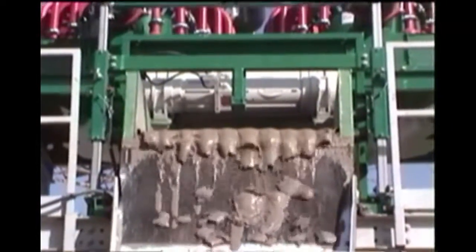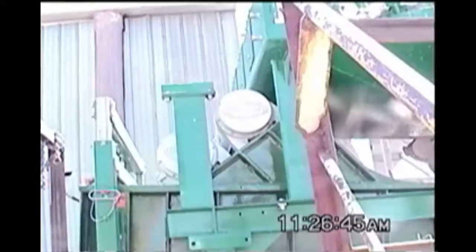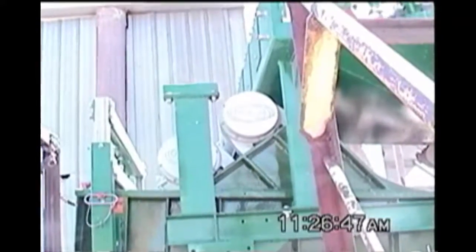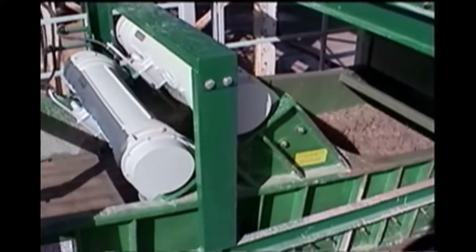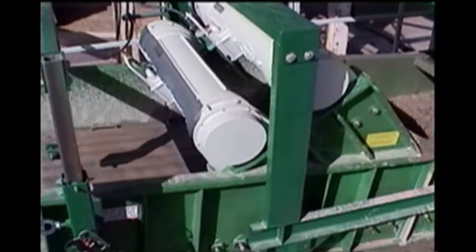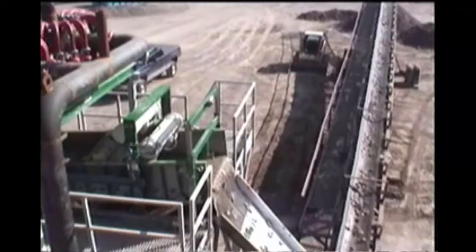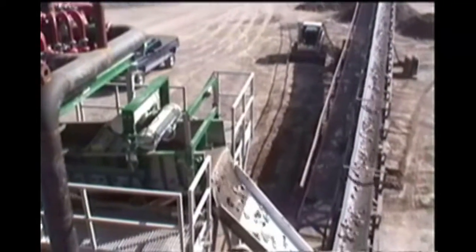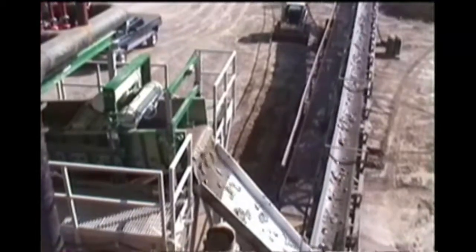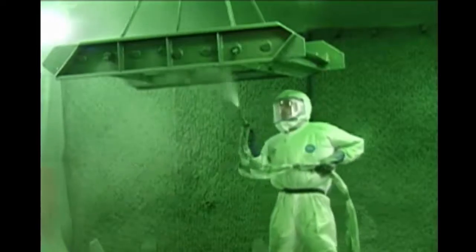Note that the hydrocyclones make the separation and recovery, not the screening unit. The high G-force linear vibrating action is provided by two Derrick integral vibrators. This high intensity vibration allows for maximum dewatering potential and provides for extremely high tonnage discharge rates. The screen frame itself is designed to withstand these high intensity vibrations and efficiently transfer these forces to the screen surface. The entire screen frame is also coated with 30 mils of high solids urethane for needed abrasion resistance.